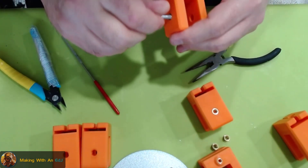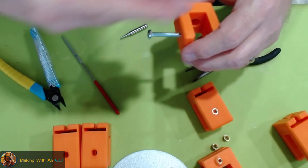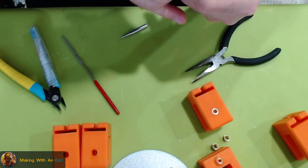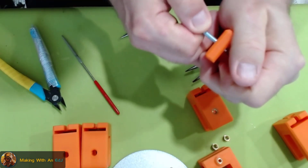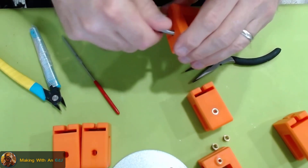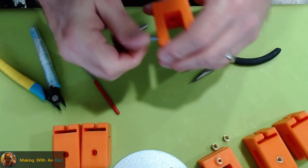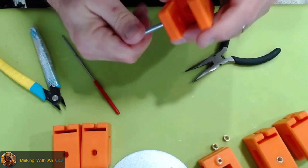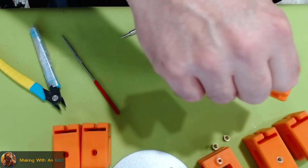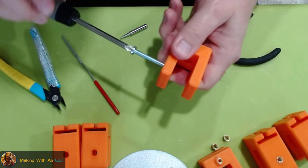The 8-millimeter seems to work fine. Checking the knurling pattern — I'm pulling on this pretty hard and it's not budging. I'm way more than happy with the strength of these. I thought the angled-knurl style would logically be stronger, but these are holding fine. Now for the 6-millimeter one — there must be some plastic in here because I'm running into some resistance turning it by hand, so I'll finish it with my screwdriver.